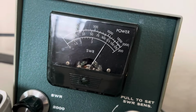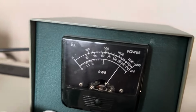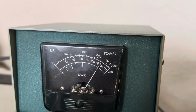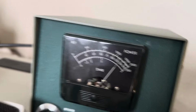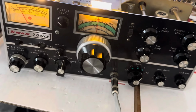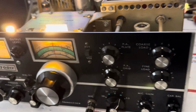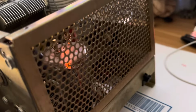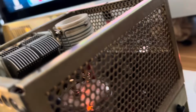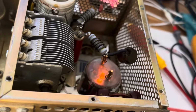This is pretty cool. Going back to 135 watt power. Continuous duty. This sucker's just not going to blow, is it? How happy am I? You can never do this with an 8950 sweep tube. You blow it up. This thing is just cranking. It's not red plating at all. It just says, ha ha ha. I'm pretty happy with how this little deal turned out.